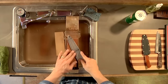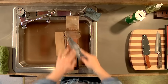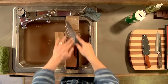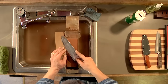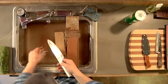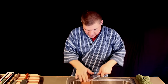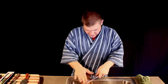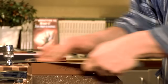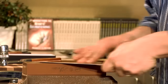Now, some people want to know, at this stage, do you have to grind your blade back and forth in the stone? Some people like to remember that their grandfather taught them how to do circles on the stone, or figure eights. At this stage, you're just grinding metal away from the blade. It doesn't matter how you do it, as long as you grind the metal from where you want to grind the metal. And when you visually inspect it, you confirm that that's exactly what you are doing, is removing metal in a predetermined way.